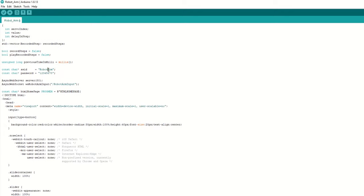Inside the setup function, we will call the setup pin mode function, then begin Wi-Fi using soft AP mode. Set up callback functions on root and on not found. Then attach the WebSocket handler to the web server. Now begin the server. Inside the loop function, we just need to call the cleanup clients function to clean up old client connections. Also call the play recorded robot arm steps function if play record steps is true. I have provided the link to the code in the description below. You can upload it directly.